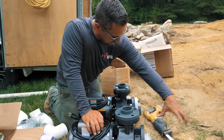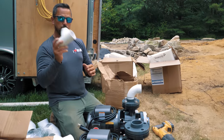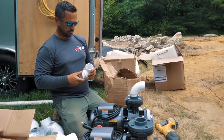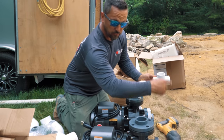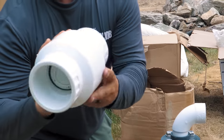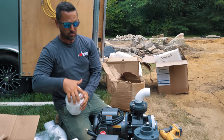We're going to be bringing our 3-inch suction lines into the front of these pumps. Then from there, we're going to discharge. At the top, we've got a Street 90 — just a fitting that glues right into the slip end of the flange. And then after that, this is probably one of the more important pieces. This is a T with a threaded top on it. This is going to go here, with the top that threads in — we'll put some silicone or Teflon tape around this to make sure it stays watertight. Once installed, this is our discharge pipe. We're going to have a feed line that comes from the vaults, going all the way back. Inside the vaults, there's going to be a check valve — which this is a check valve here. You hear that noise? There's a flapper. You can see it inside there. What happens is when the water gets pulled through, this flapper gets pulled open, drawing all that water out. When the pump stops, the water weight will push that flapper back closed, essentially holding the water in the line.